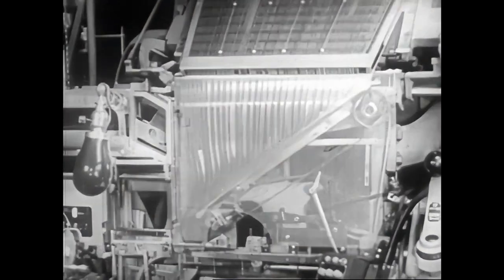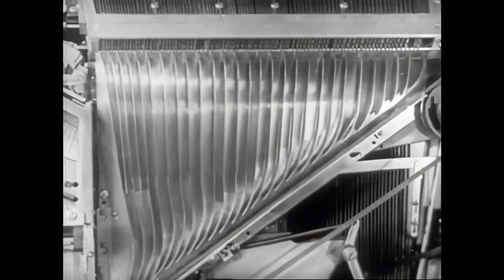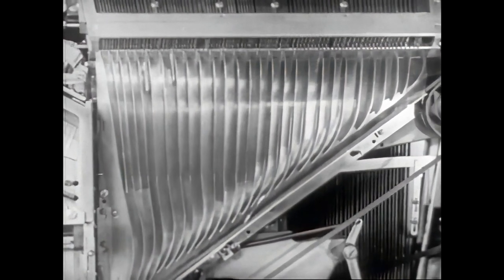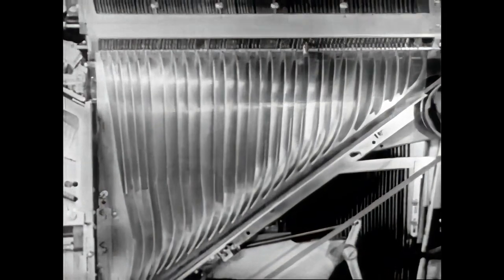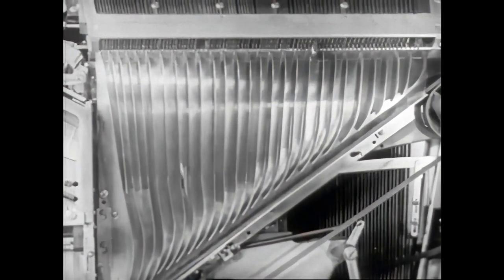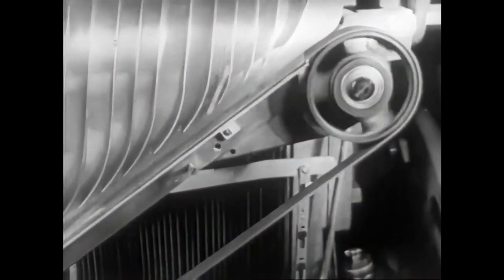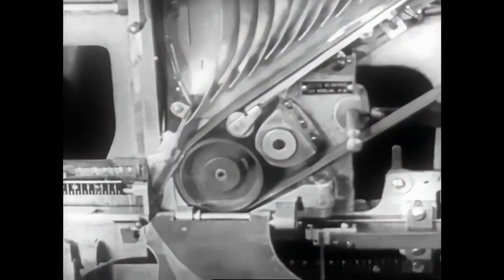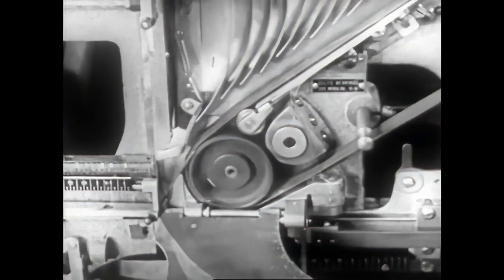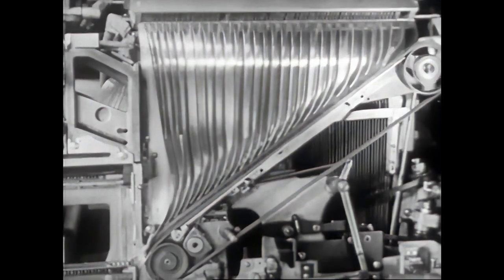The mats released from the magazines are now directed toward the assembling elevator. Now we'll see the whole operation in slow motion. They are guided in their descent by the assembler entrance partitions, which prevent them from turning out of correct position. The mats fall upon a delivery belt in constant motion, which carries them in correct sequence to the assembling elevator. It takes the same length of time for all mats to reach the assembling elevator due to the design of the assembler entrance and matrix delivery belt.